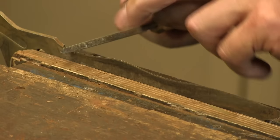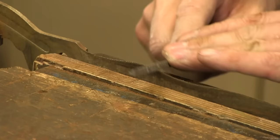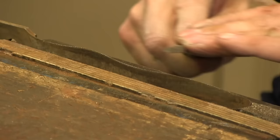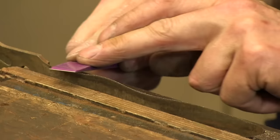I just feel for the edge. Normally my hand would be on this side putting equal pressure along here, but I'm coming in and going along this face, filing along the bevel. I've angled to follow the bevel of the original ground angle — it's got two bevels on this. That's giving me a burr all the way along that edge.